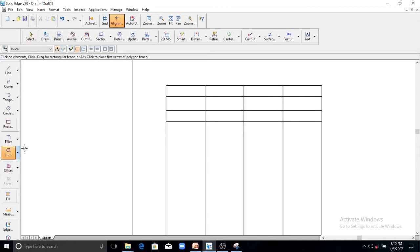So this is the center where the two plates are joining. Now this is the center for the first rivet. When you concentrate on drawing the diameter of the rivet, that is 18 millimeter, you draw two lines, 9 millimeter from the center.